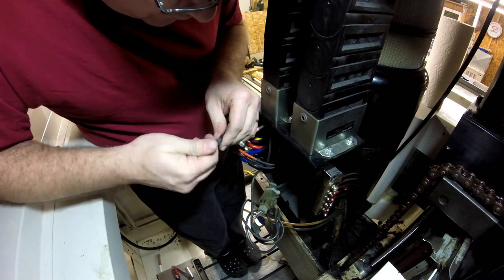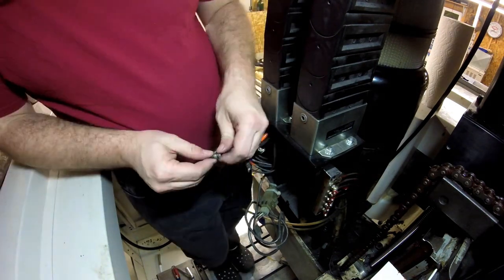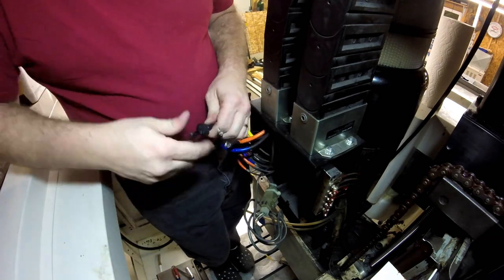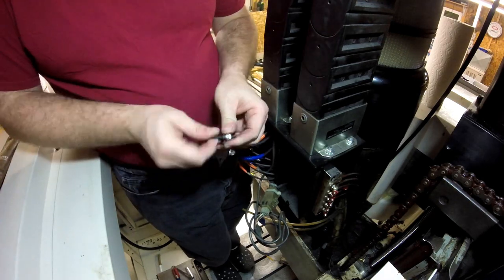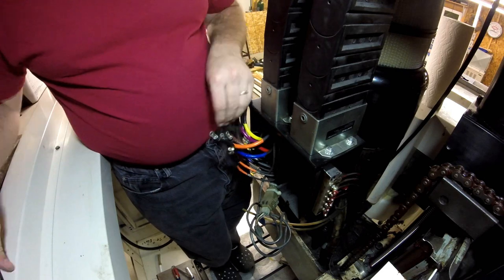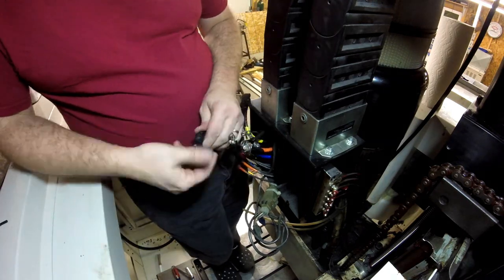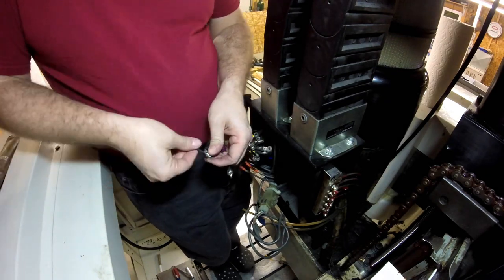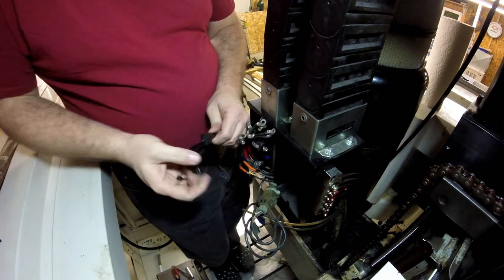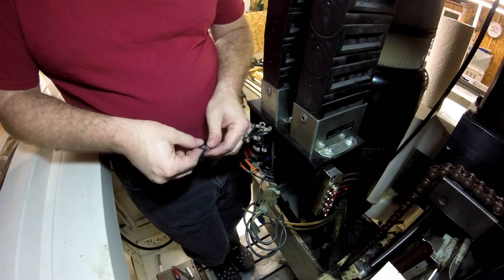You can see these wires have a lot of electrical tape wrapped around them, and they used a nut and bolt to hold a bunch of ring terminals together — that's common. Some people use wire bugs, some use ring terminals. It's nicer to put shrink wrap over it, but shrink wrap is harder to get on and off, and you risk nicking the wire when you cut it off. When you take this apart it's very important to inspect all your ring terminals and make sure any crimp connection is still good.